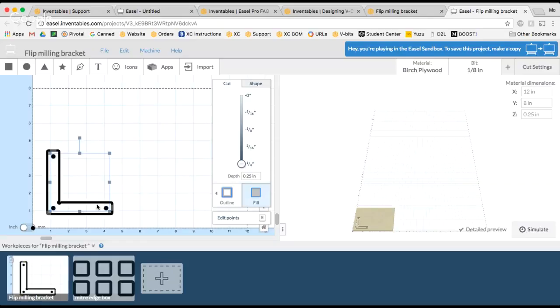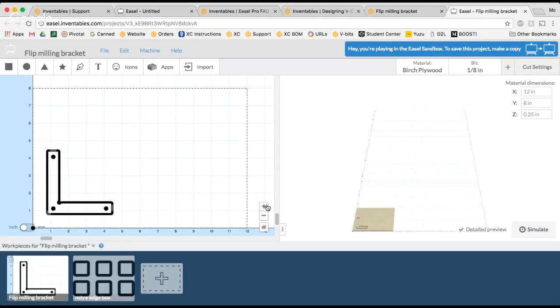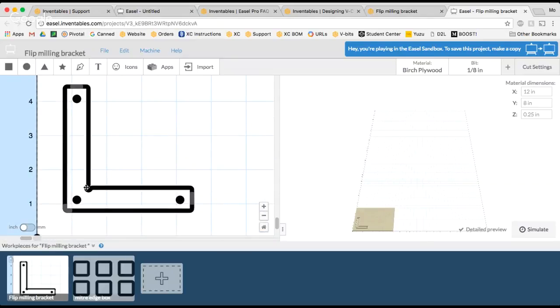These holes here are what align to the correct distance for the threaded inserts on all sizes of the X-Carve's wasteboard. So they're just the important part to make sure that you have properly aligned to each other. You can see here the shapes are actually grouped. So if you wanted to just take these 3 dots and design your own jig that works, you can go ahead and do that. And the other important part that is a little hard to see, but you want to make sure you have this little part carved out in the corner so that when you put in a piece of square material, it's able to get into this little nook and properly line up against these 2 kind of square parts of the jig, I guess. So basically your material can truly be aligned correctly.